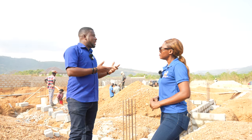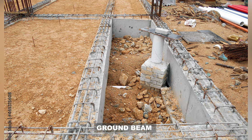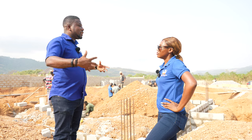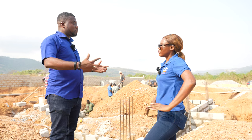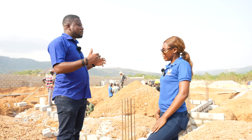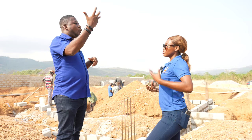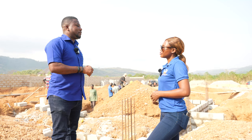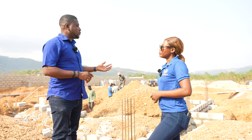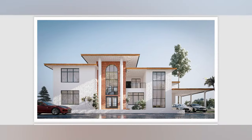We are going to have a whole ground beam. The reason is that it's a huge building — normally when you have something that is huge, the ties are supposed to be quite large. Beams are the ones that carry the load and transmit it onto the pillars, and the pillars transmit it to the foundation, and the foundation to the earth. So you will not see these blocks going very high because there's another element going on top.